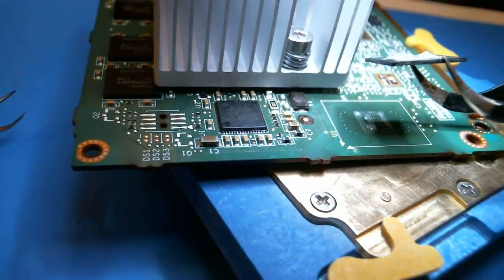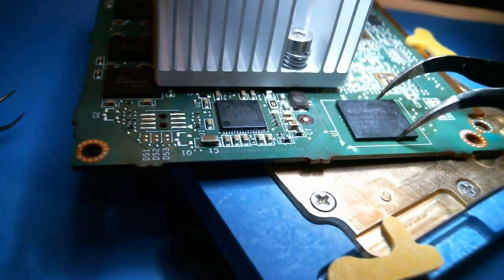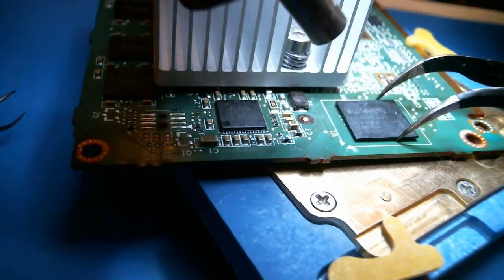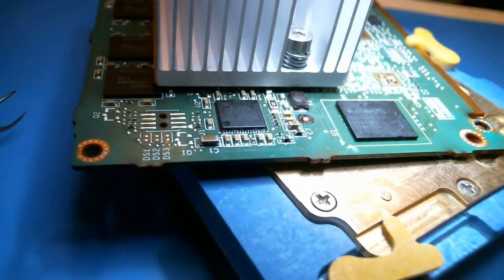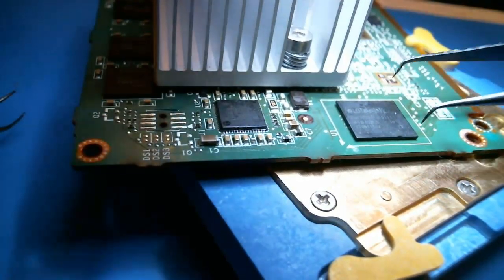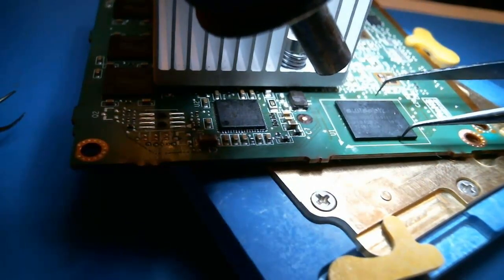From what I understand, if there's an error, it hammers the log files — similar to like an iPhone — where it just hammers the NAND chip until the disk space on the NAND drive fills up and then it kills the system. That same thing is happening on the Tesla Model S 2012, and the only way to fix it is to take this NAND chip off — which is the black chip there — and basically put all the contents of that disk onto another new chip, then re-ball it and put it back on this unit.